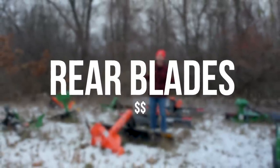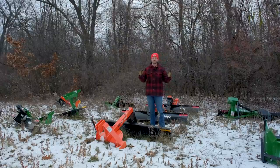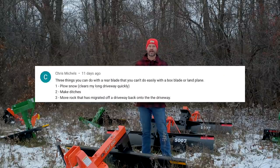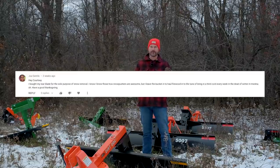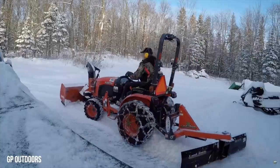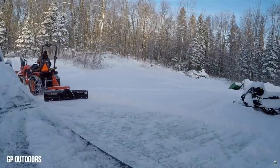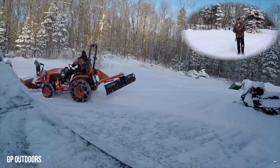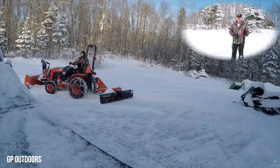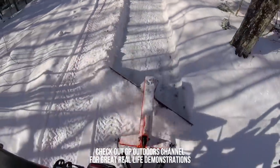The rear blade came up when I asked for opinions on where folks prefer it over other attachments like a box blade or land plane. For me, a rear blade is probably at the bottom of that pile, but the one place where the rear blade does excel - and folks mentioned it as well - is for moving snow. You might hear these called grader blades, road blades, rear blades, or flat blades. They're one of the cheapest tools you can get, and you can use them not only for moving snow but for grading out your driveway or landscaping jobs. Make sure you get something wider than your tractor - at least a foot wider - because when angled, you could knock off as much as a foot of effective width, and the last thing you want is to not cover your tracks when plowing.